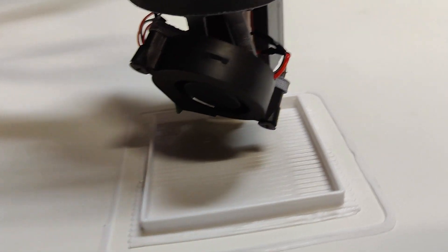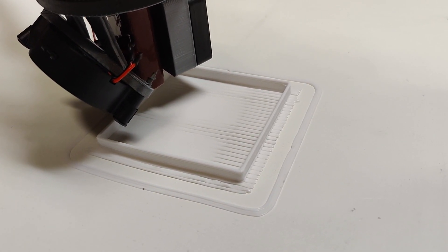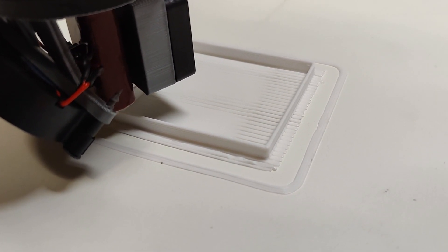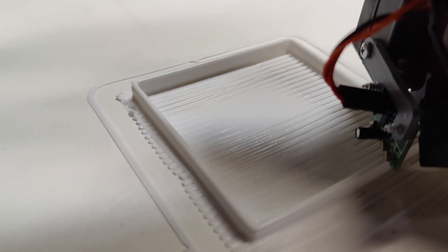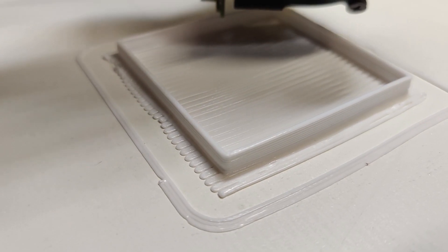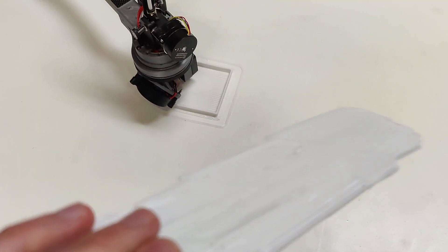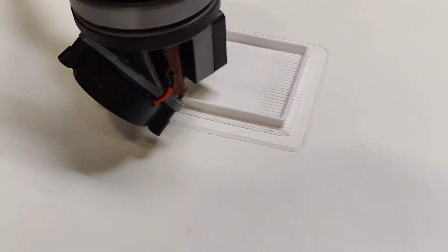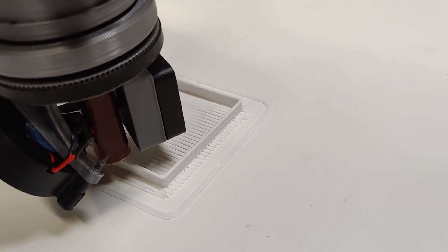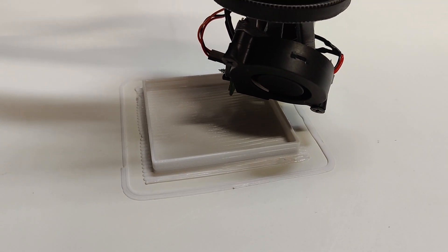As you can see, it is printing with the new whole assembly. It's a little bit different, but it just has the hotend mounted in the center. Right now it's the beginning of the print and it does work. Noticing in these first little parts, the print is a lot more glossy than it was on the other one — you can kind of see the shininess. On my other prints, I don't think the filament was getting melted enough, so it's not very glossy, it's very matte. I'm taking this as a good sign that the print's going to work.